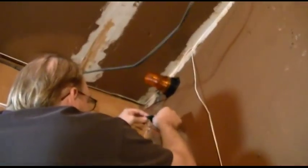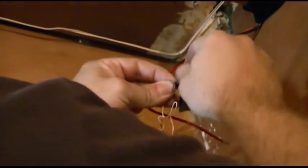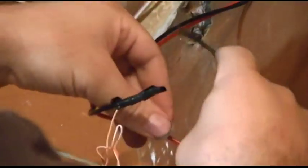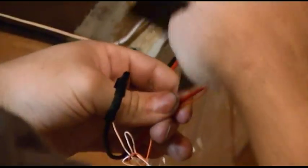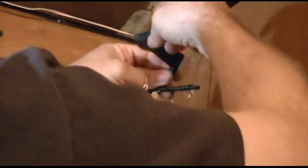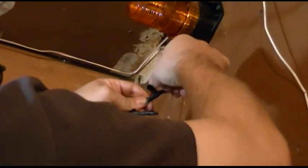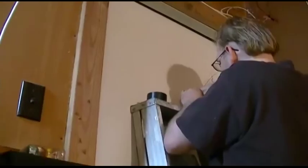Okay, so now it's just a twist and tape job. These are never going to be touched, so that's it. We have the solid orange going to the red wire. The stripes — white and orange — going to the black wire. All the stripes will be negative. The solids will be positive.